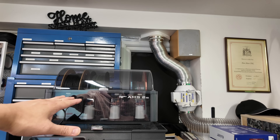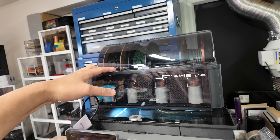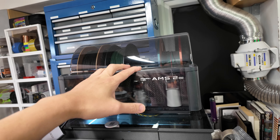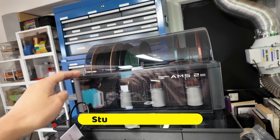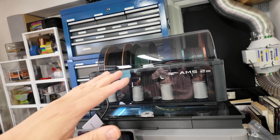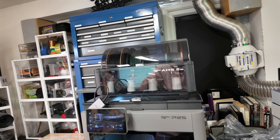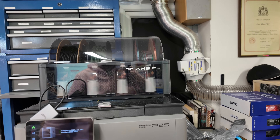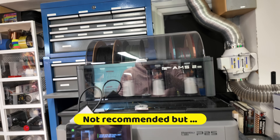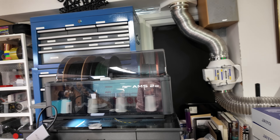The AMS is fantastic for being lazy. I never really use color change because I think it's just too wasteful. It's handy that when you run out of filament you can use another spool next to it and also keep things dry. I have drying agent between the slots and the AMS is working fantastically well. A lot of people say you shouldn't use carbon fiber filaments in there because it's going to wear out the parts — yes it will, but I'm not a big carbon fiber user.